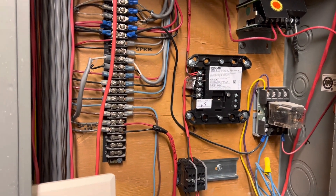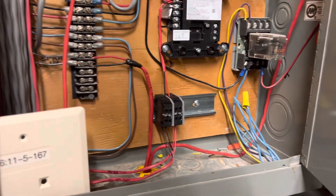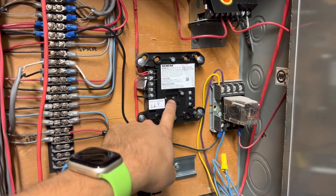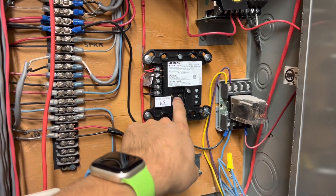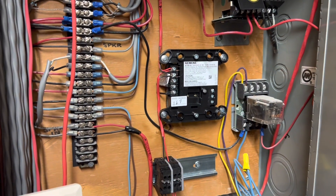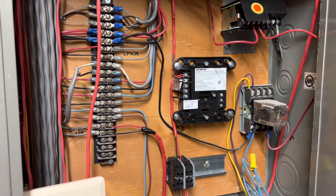The rest of the day I'll show you some footage from. I also did some programming — I don't have footage of that — but it was pretty cool to program these XTRIs. Basically you plug in this little plug-in right here, punch in a number, and program it. Right here, this is address 167. You plug in the device, punch in 167, hit program, and then you label it on the boxes. I did 20 of those for the tamper flows — two for every floor, 10 floors.